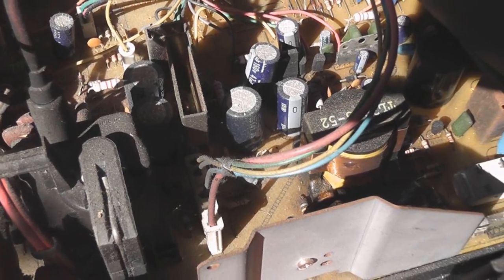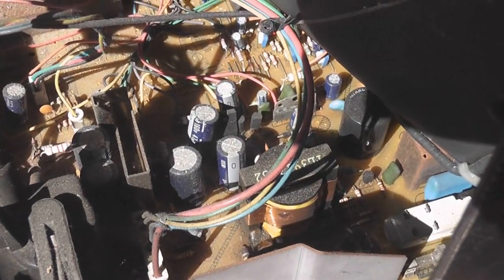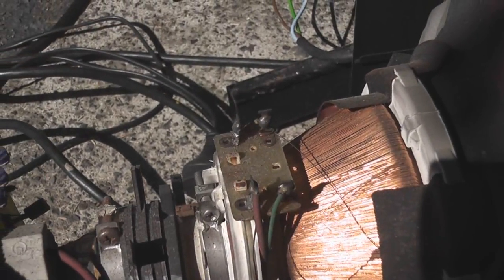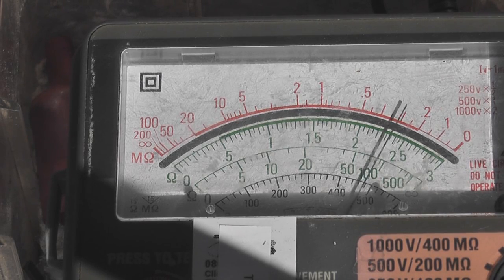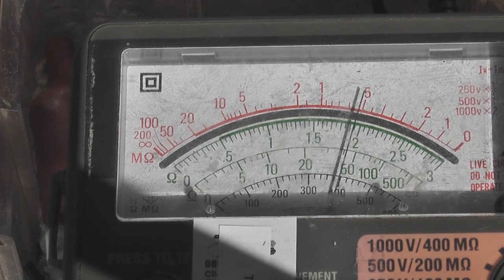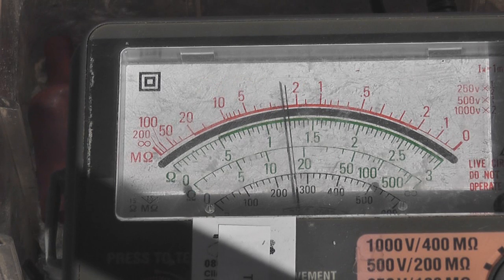The wires which have my main interest at the moment are these four wires: red, yellow, blue and green. They're driving the deflection coils. The meter is on the 3 ohm scale. Between red and blue we got nearly 1.5 ohms. Between yellow and green we got about 18 ohms.